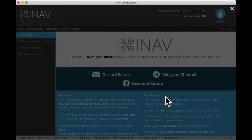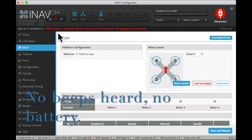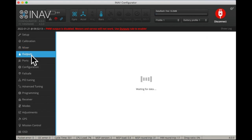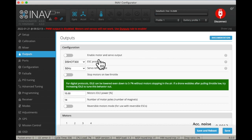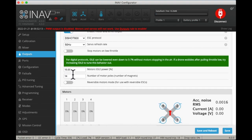Now when you come back, you should hear your full set of beeps. The motors won't do anything, so we have to go to Outputs and turn them on — enabling the motors right here. Turn that on. We're in DSHOT 600. We don't need to change these two settings. That motor idle is kind of high — I would like to lower that. Let's make that five for now.